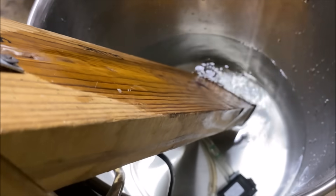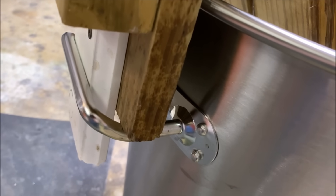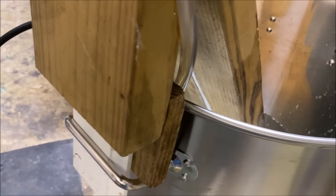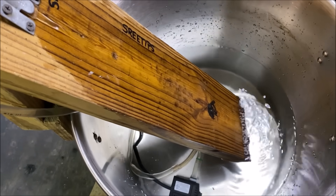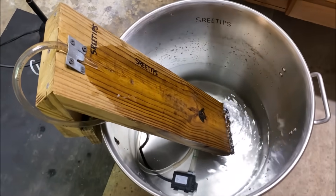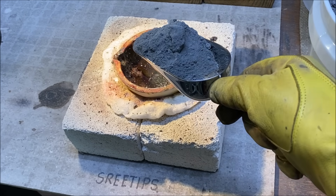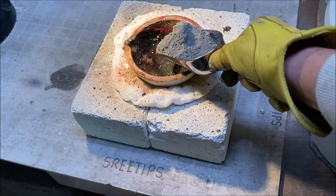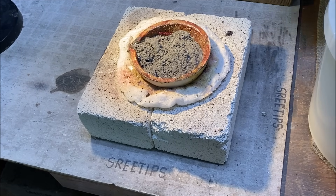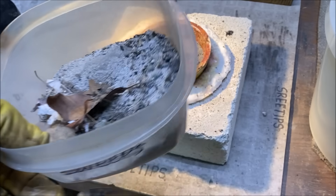As I pour the molten silver in. The board is just a contraption I built — it fits down into this handle here, wedges in there nice and stable. This is what we'll use to create our impure silver for the silver cell. I'll begin by adding a scoop of cement silver from my bucket over here into the crucible.